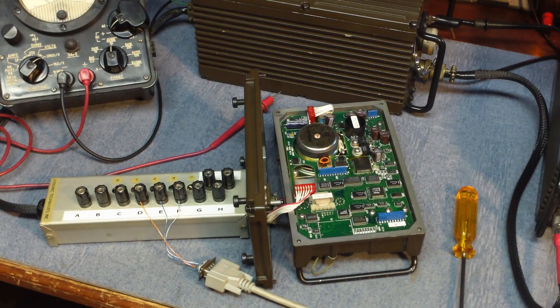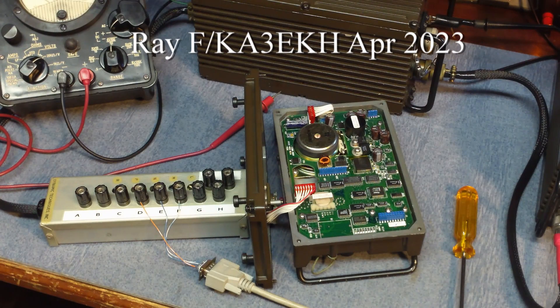You can see with the adapter it makes it a lot easier to open the head up and get access to it when doing diagnostics. You'll notice this head's missing its backup battery — I'm still waiting for it, so we'll see once I get the backup battery if it helps the situation. In the meantime, it makes it easy to check voltages and statuses and things like the clock and the reset bus with the adapter open like this.